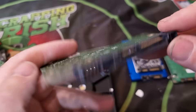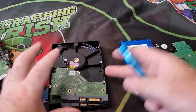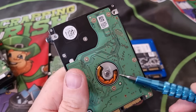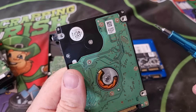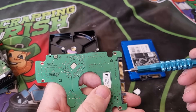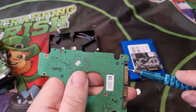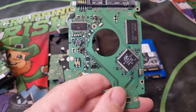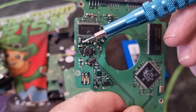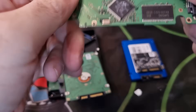So for the SATA board: remove the chips, remove the MLCCs, remove the pins, trim around wherever there's gold flashing if you want, and collect the gold connector pins along the edge. That covers the SATA board for precious metal recovery. Moving on to the laptop board — the connector pins are sometimes gold-flashed, not always, but keep an eye out for that. The board itself has pins along the edge to remove and collect. Quantity is what you're going to need — a few pins alone won't yield much gold.